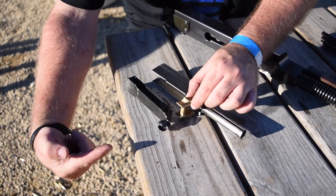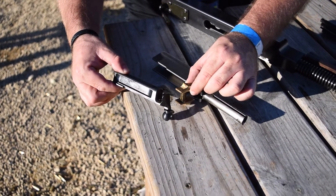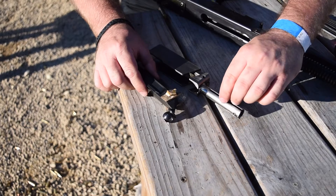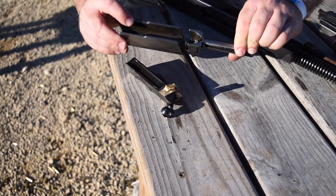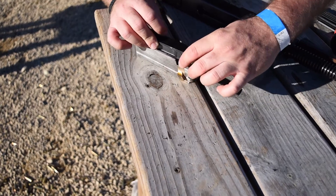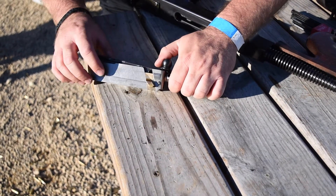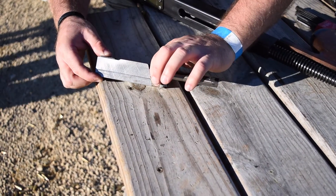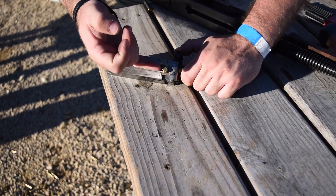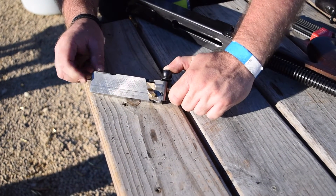This is the top of the gun, bottom of the gun down here. This is the charging handle — you can see how it's cut to attach to the Blish lock wedge. The bolt has its cut to the wedge just like that, and then the charging handle fits inside there. Once they are put together, they fit like that, and completely forward it locks like that. When you fire, that wedge has to be lifted up before the whole assembly can come back, and the coefficient of friction between the brass and the steel in the receiver is what delays that Blish lock.